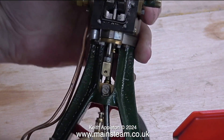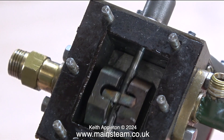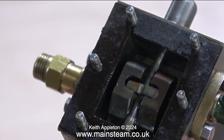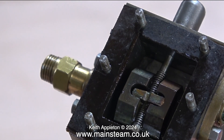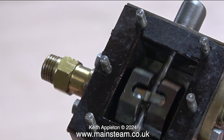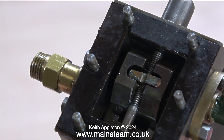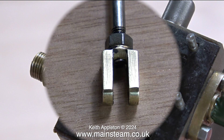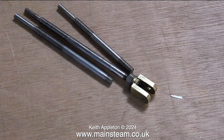Inside the steam chest is a gunmetal slide valve, which controls both the admission and exhaust of the steam. The driving bar looks to be a slack fit on this valve, and it's supposed to be — the slide valve needs to float freely in the steam chest; it's only the pressure of the steam that holds it in position. The main problem with this valve rod, apart from too much thread at the bottom end where it goes onto the fork, is that the top part of the thread won't let it travel far enough.